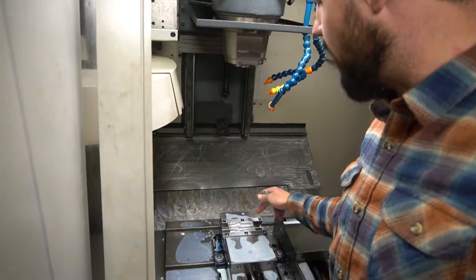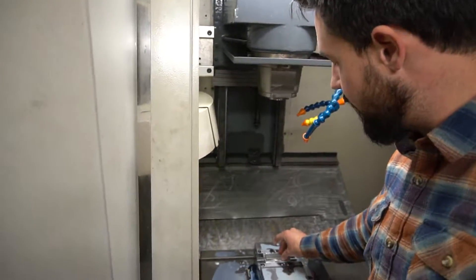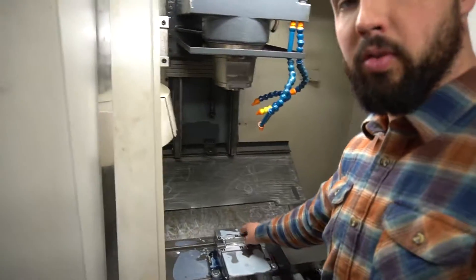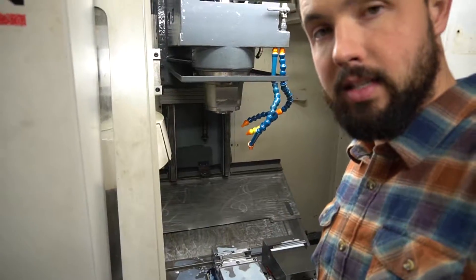It's not going to go into the grass very well, and you'll probably have a superintendent chasing you down asking you what you're doing to his putting greens with this repair tool. So we have to flip it over, put it into the vice a second time, and take this flat part off the top of it. We have what's called a soft jaw that's made the exact same size as the top of the repair tool. It fits down perfectly inside of the soft jaw, and then we tighten it down with a reasonable amount of force so that when we're cutting with the end mill, it doesn't rip this out and fling it somewhere inside of the CNC mill.